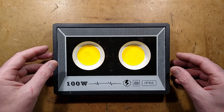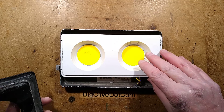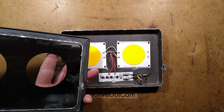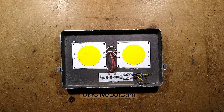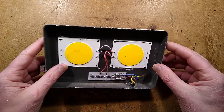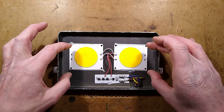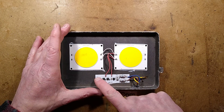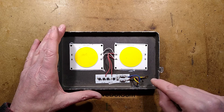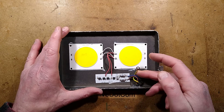The Dremeling is complete and I've made a huge mess — this is not unusual. Off comes the front reveal. A little flimsy plastic light guide. Isn't this just going to melt if it was used at any decent power? The circuit boards inside are just glued in. Those pillars I thought were going to be screws, but they're not. The modules are literally just two modules, and then there's a separate linear current regulator. There's the earth wire — I'm surprised it didn't make a connection. It was just touching the case like that, but really just floating.